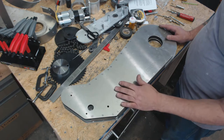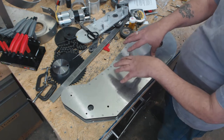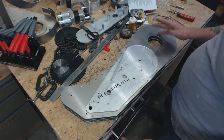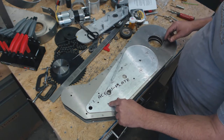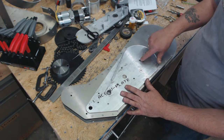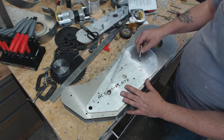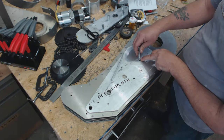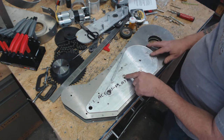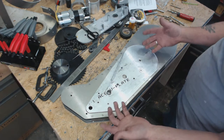We decided we're not going with linear actuators — we're going with the eccentric drive. And therefore we need a series of holes in here that the eccentric drive outer plate keys into. There's a clearance hole here for a quarter inch, and then there's another clearance hole, quarter inch, and then there's a hole here for a three-eighths inch precision clevis pin. This clevis pin actually goes into this and is kind of press-fit in here — it's not supposed to rotate during operation. And then there's another hole here for getting in there with a flat-bladed screwdriver to adjust the potentiometer for the feedback for the eccentric drive.